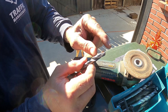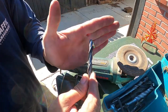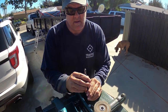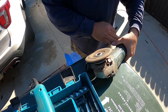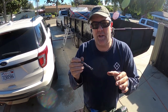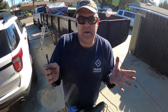So guys, you want to keep the face of the stone right on the face of the bit. You want to keep the angle, but you also have to angle it this way just a little bit. You don't want it too flat — otherwise this cutting edge right here won't bite the metal. You also want to make sure you grind evenly on each side. They also make a nice little bench sharpener where you stick the drill bits in with a preset angle and get a perfect cut every single time. They're actually pretty cheap and come with a nice fine stone that's really good for carbide drill bits. This is kind of the rough-and-tough field way, but the bench sharpener is way better.